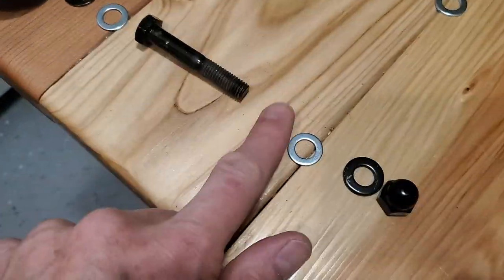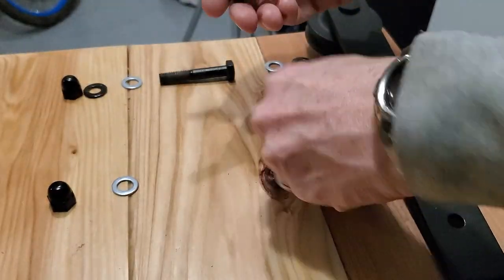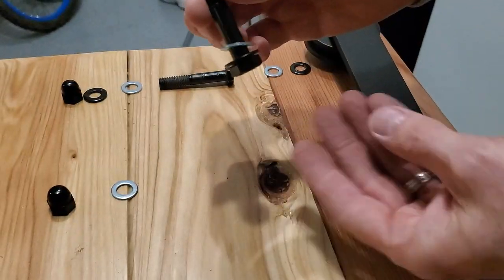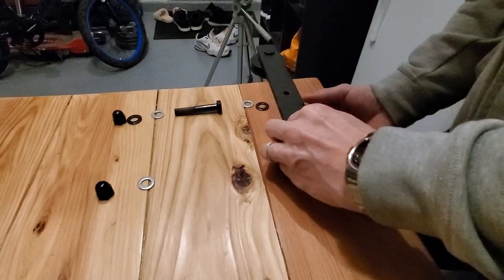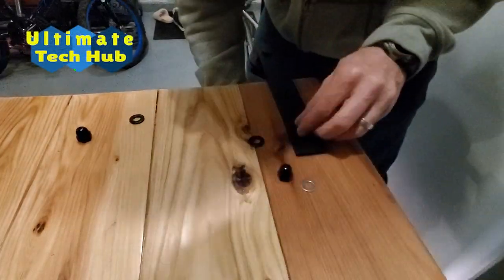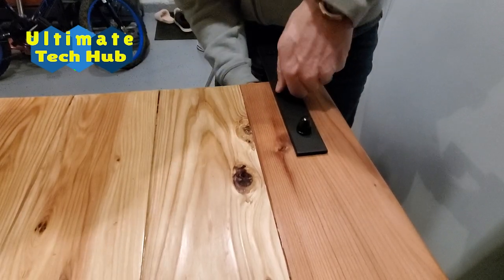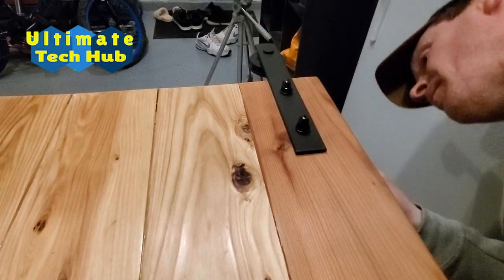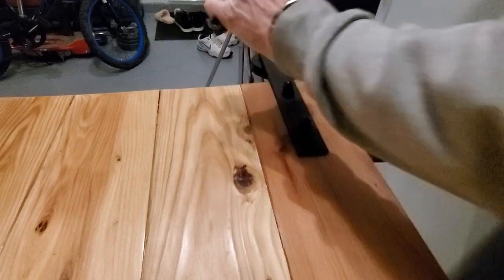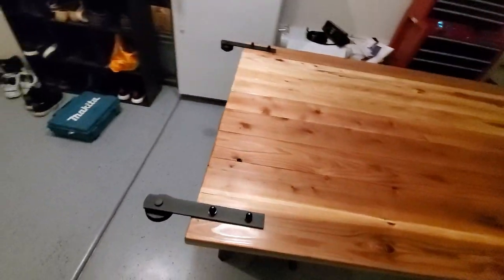The bolts that come with these hangers are about 1/4 inch too long. So you have 2 options. One is to cut the bolt, or you can just add some washers. I chose the easiest option, just add a few washers to each side. Use a wrench to tighten the bolts, but don't over-tighten, you could crack the wood. Hangers are hung.